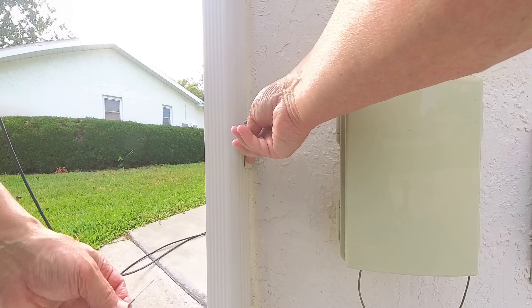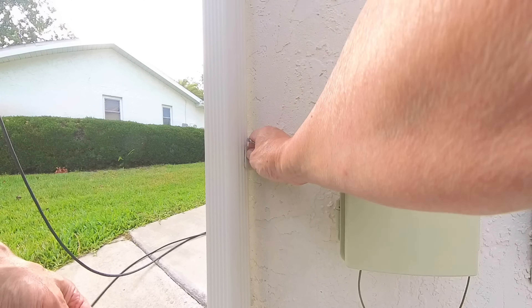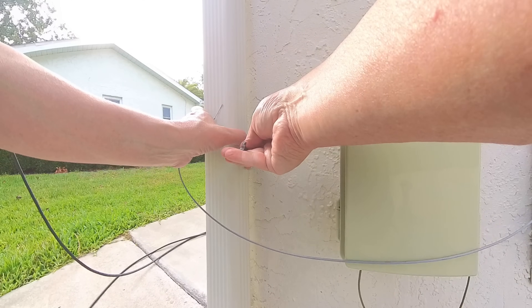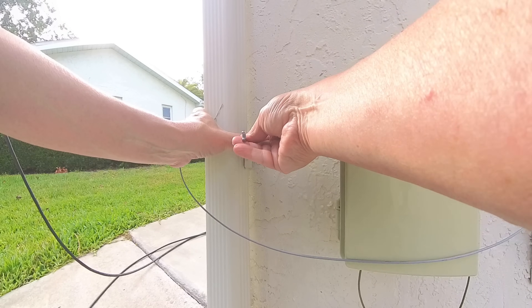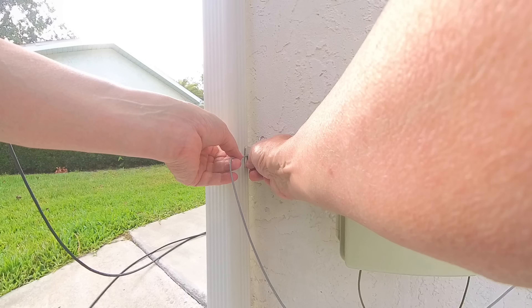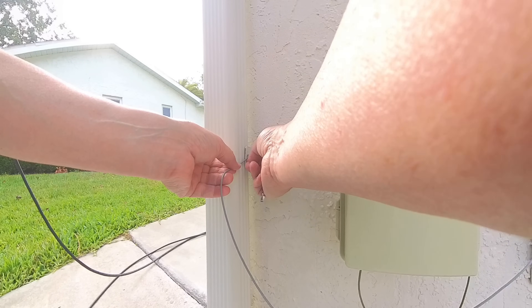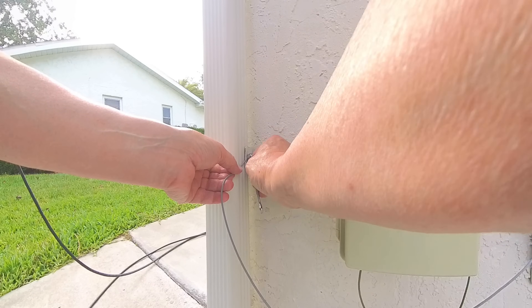I chose the URT1 because it's a remote tuner. I can load this thing up and get my match right at the quote antenna — i.e., the downspout and gutters. Therefore, my signal back to the shack doesn't have loss other than what my cable is providing. I get the match right here at the magical antenna.